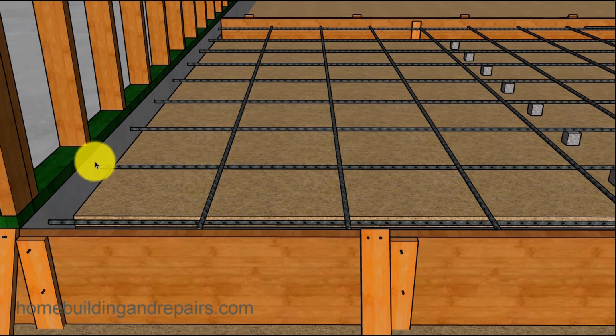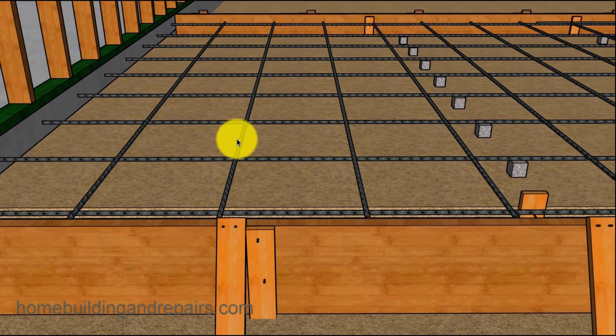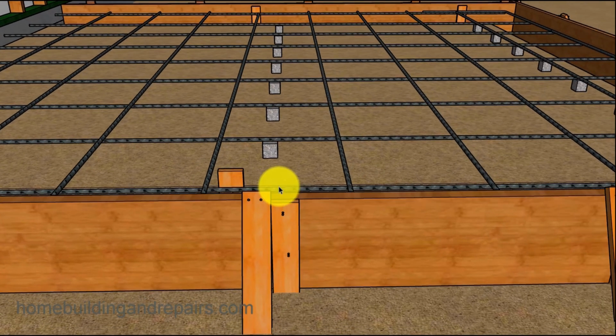But if 2 inches is the minimum, and you have an inch in here, then it's probably going to be 2 inches. That's probably more of where I'm at here, not 2¼. And if that's the minimum distance for rebar, then you're going to have to make sure that you figure that out. Like I said, a 4-inch slab just might not work. So here they are lining up.